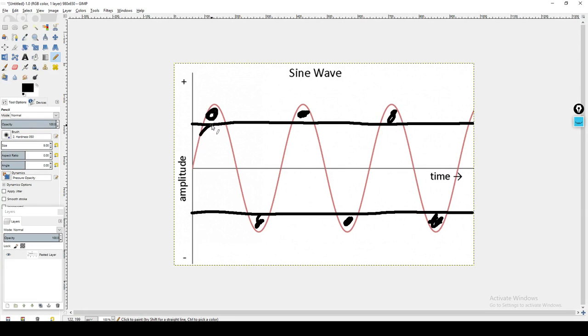Now, the rate at which, right, so if I draw a little bit of a softer clipping, that's an important thing to think about. Certain ways of clipping the signal or certain types of diodes may soft clip, meaning this edge gets kind of rounded over. It's a little bit more gentle. And actually, I think to make it more accurate, it would probably be on this side of it. So like that. That would be more of a soft clip. But then a hard clip is basically what I've got right here, where this entire thing gets clipped off and it just hits this and bam, straight lines straight over like a sawtooth square wave.